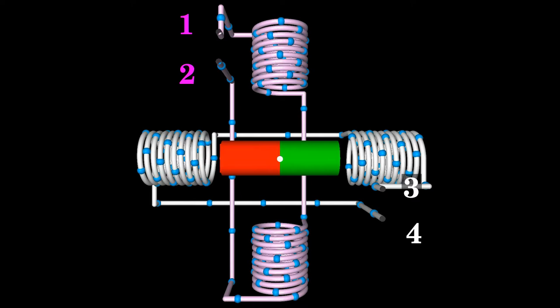The motor has four terminals in total, two for each phase. As shown in a previous video about brushed DC motors, the electromagnetic field is caused by the movement of charged particles. As soon as the vertically aligned coils are connected to a DC voltage source, the blue painted electrons start flowing through the wire of the coils from the negative to the positive terminal.